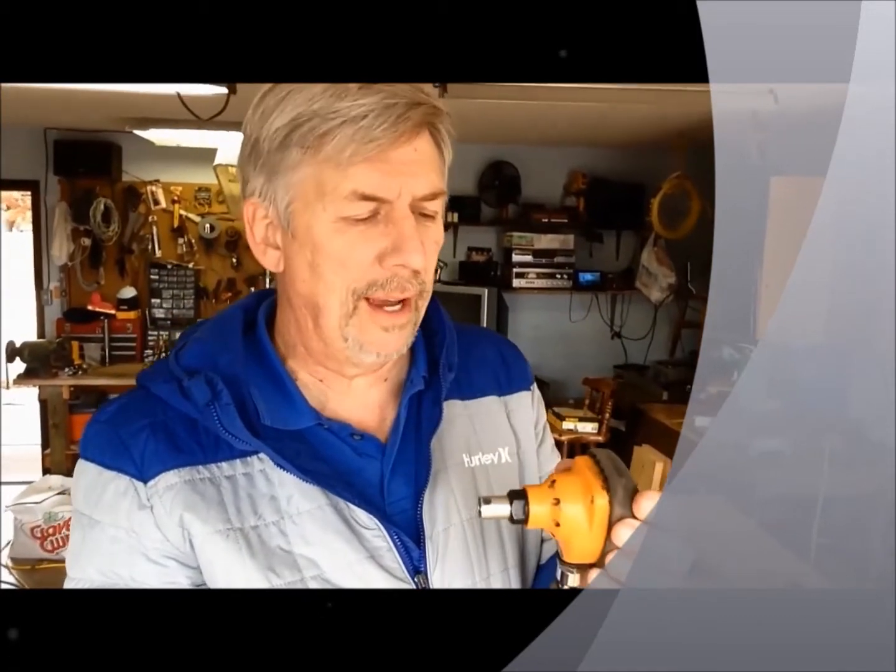Okay, in a few videos back, I told you I would show you a way to nail stuff if you didn't have a nail gun, and a lot of people don't. So I'm going to show you 2 different ways to do it, easier ways than just grabbing a nail and starting to pound. This one is going to use the palm nailer, which you can buy for $35. It's not completely designed for 16-penny nails, but there's a way you can make it work.